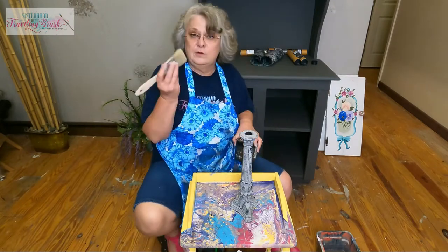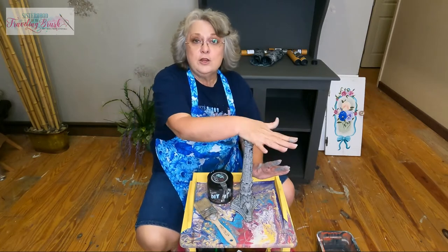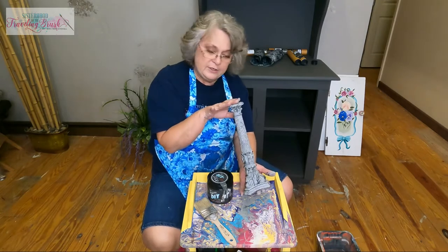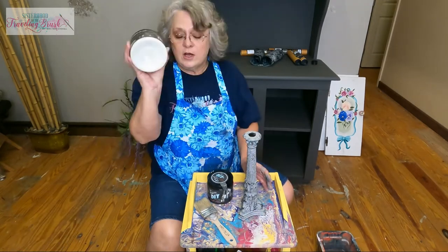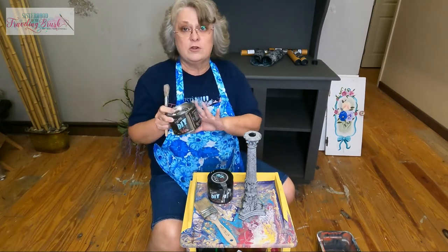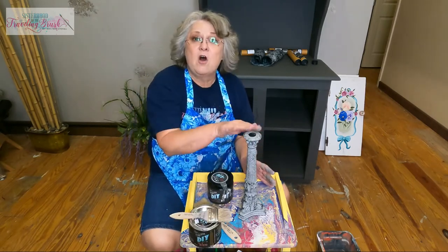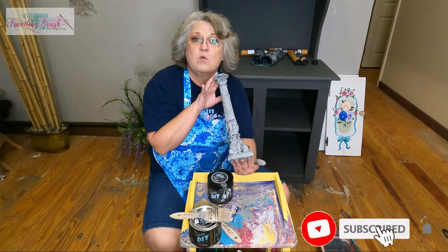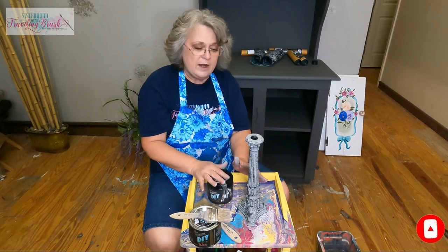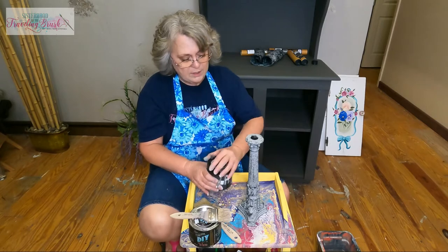I'm just going to apply the dark and decrepit, which is a liquid patina. Here, our options with the DIY paint line would be to use crystal clear patina, dries clear, or just dark wax anyhow. That I still may put a coat of this over that, we'll see. But I'm not wanting to have to dig down in all the details of this with my coats of wax. So that's why I decided to do a patina. And I could do clear, but I decided the dark would deepen this up a little bit more. So that's what I'm gonna go with.